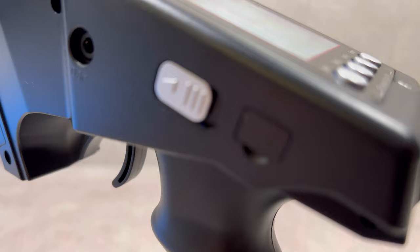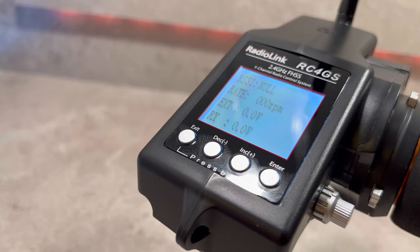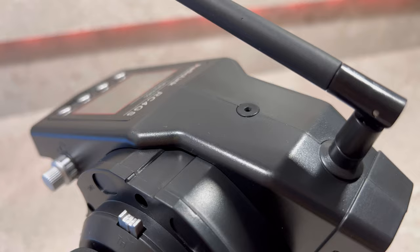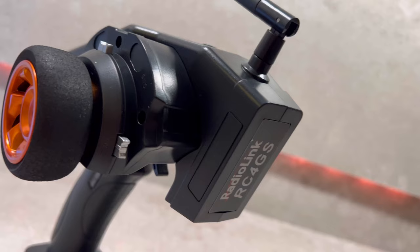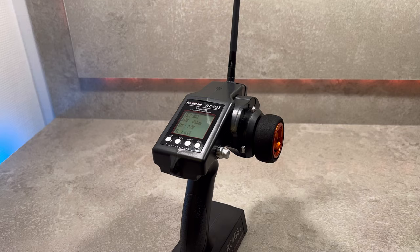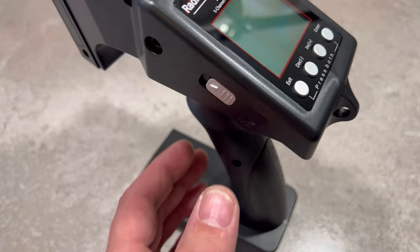Let's take a deeper look at some functions. This transmitter is really a performance transmitter. We have a head-tracking port and a DC port — at the DC port we can also connect head-tracking FPV if you have it, and power the whole thing from 2 to 4S LiPo. All Radiolink receivers work with this transmitter. We have 30-model storage, telemetry with a cable, a screen mount, 5-channel transmission, a USB-upgradable port, 400 meters of range, adjustable gyro, mix control for dual motors, and a one-switch function. We can put any switch we like for EPA, mix, or dual rates.